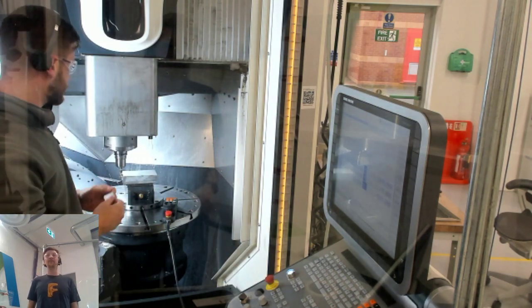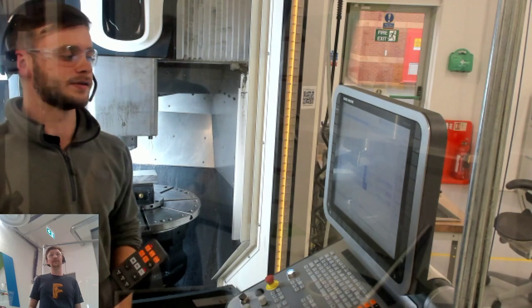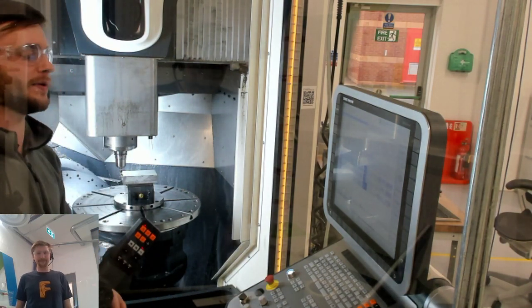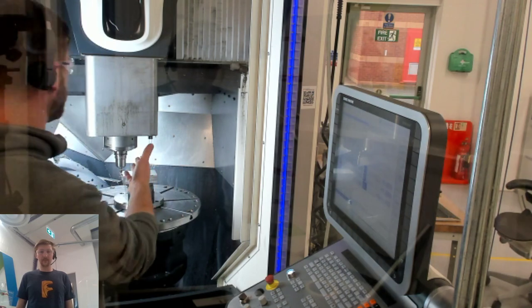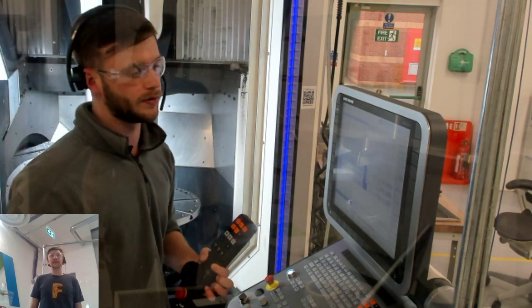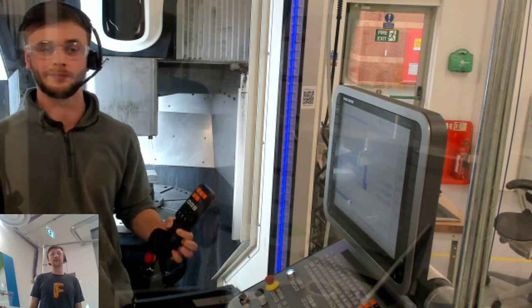Yeah, so that's just nipping the paper now. And you'd probably argue it's not as accurate as maybe a touch probe. Maybe not as accurate as using a slip gauge, but it gets the job done, especially when you've got stock. I mean, I'm not that bothered about 0.1 there, really. If it's a side two setup and you're referencing off machine faces, maybe that's a little bit different.